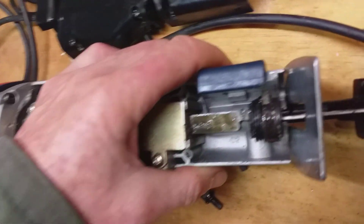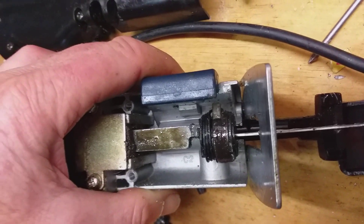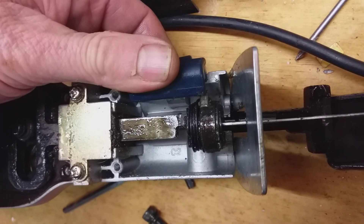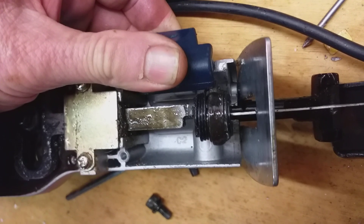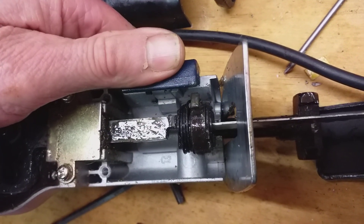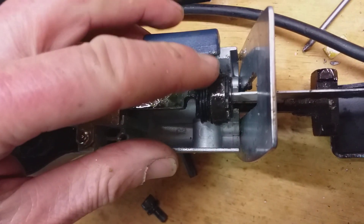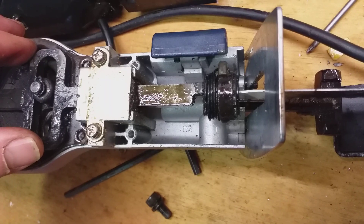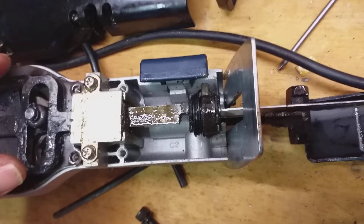What you're trying to do is free that up. I've covered mine in spray-on lubricant — WD-40 or CRC or whatever brand it was — and I've got it moving again. I had to put a pair of pipe grips on there to move it, and I ended up putting a metal punch on it and tapping it pretty sharply with a hammer to break the rust off, and now it's up and running.